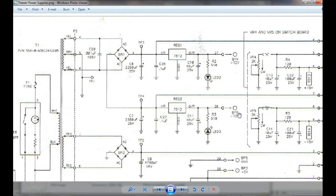Saying something's open is really not a good answer. It's like going to the doctor and he says something's wrong with you — or like when I was told I have an infection somewhere but we don't know where it's at. So look — what's between here and there? It's got to be the 7912. That's the regulator.